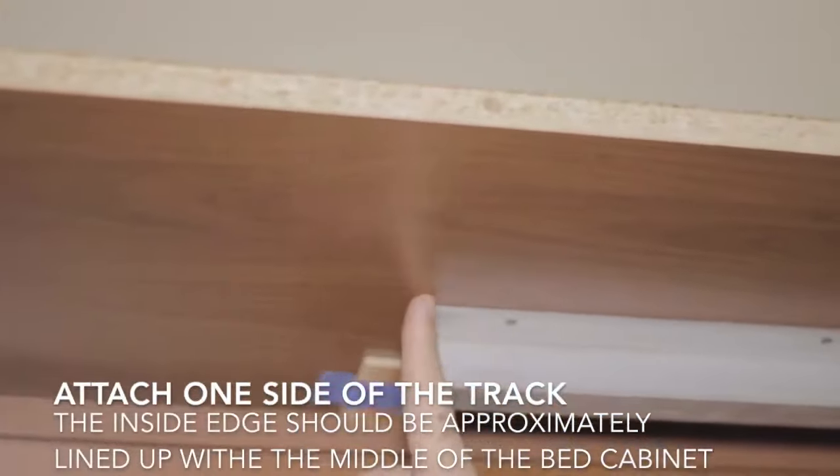Now we move on to assembling your steel bed frame — follow the written instructions very closely. You assemble the left and right floor yoke just by hand at first: hand-tighten those onto the bottom spring bar, the angle braces, and the yoke connector bar, then secure them with a half-inch wrench and socket. When you assemble the bed frame, hand-tighten the bolts all the way around for the weldment, the stiffeners, and the foot before securing them all in place. It helps to measure diagonally corner to corner to get the frame as square as possible before you tighten those bolts with a wrench. All bolts come in through the bottom if you have the frame laid upside down, and the nut will be on top as you assemble them.